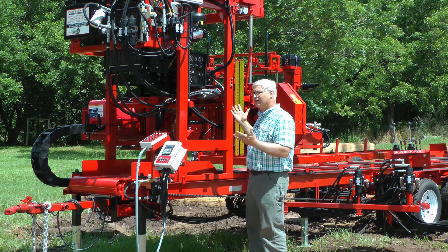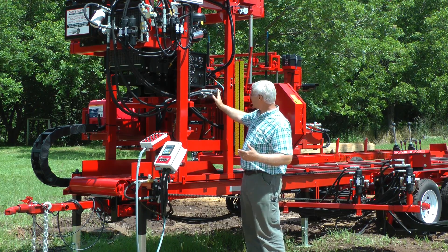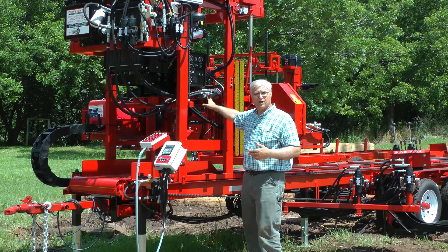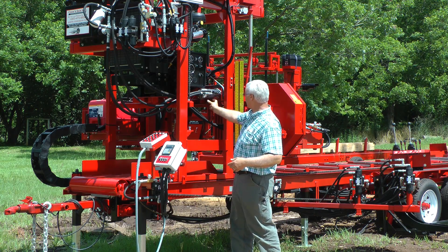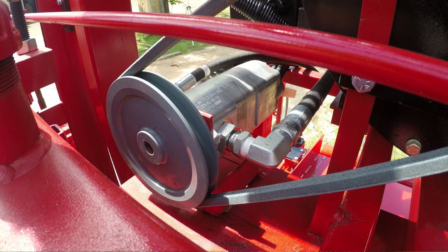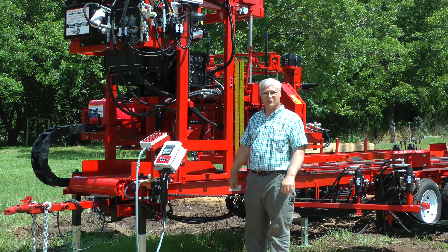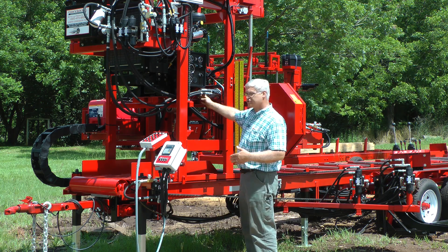The hydraulics on our AC36 here — we have a hydraulic pump. In this case, we've got a double hydraulic pump. All that means is there are essentially two hydraulic pumps. You can see there's a hydraulic pump here and a hydraulic pump there. If you have the single one, you look at it and go, oh, they just bolted two together — and that's essentially what they did.